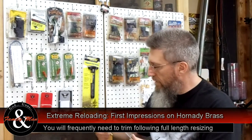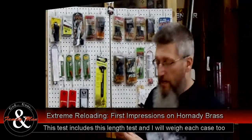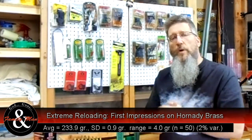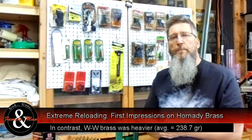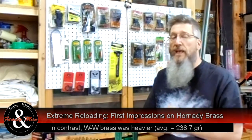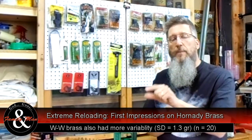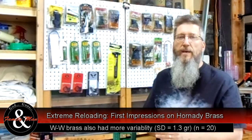There are 50 cases here and I'm going to test all 50. I just completed our tests on this Hornady Premium brass for the 338 Winchester, and I had a chance to run the statistics shown on screen. My first impressions are that this is pretty good brass. On the overall length test, every one of these pieces fit within SAAMI specs. I did notice as I was sliding those cases into the gauge that there was a fair amount of variation — none exceeded maximum length, but some had a fair amount of light showing between them and the top of the gauge.